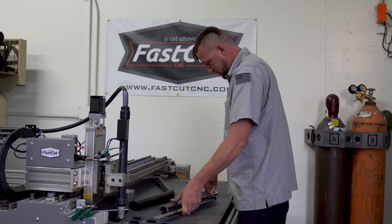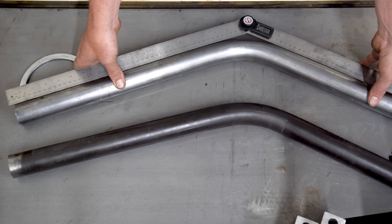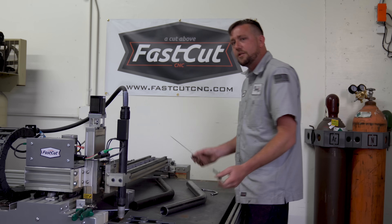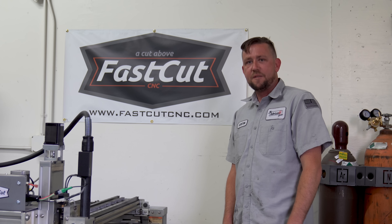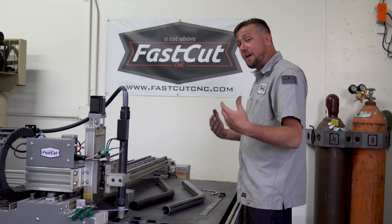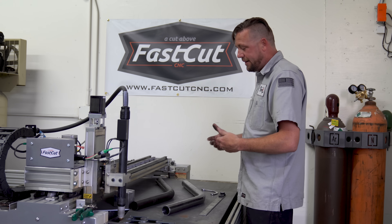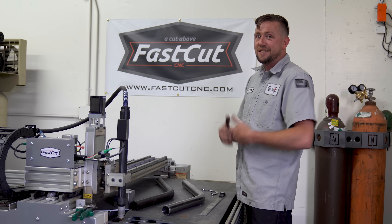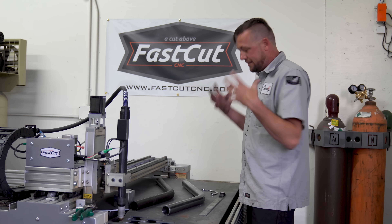Now for the ERW — let's see where this one lands. Flat on the legs, not worried about the apex. This one comes out to 135.5 degrees. If we do the math on that one, 180 minus 135.5 gives us 44.5 degrees net — a difference of half a degree. So if I wanted to bend inch-and-three-quarter 120 ERW in my Rogue Fab bender to get 45 degrees, I need to bend it to 45 and a half degrees, because there's a half a degree of spring back angle on that bend.